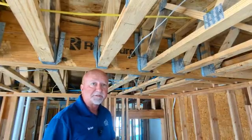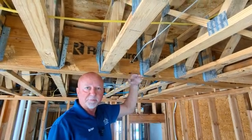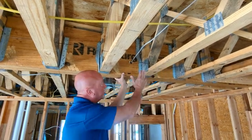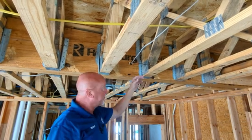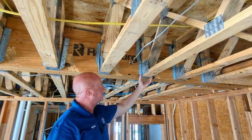Significant find for this particular inspection. So these are floor joists holding the support from upstairs. These are LVL beams. Basically, when we attach our floor joists to the LVL beams, we put joist hangers in to help support them to make sure that they don't slide out of place and they have proper strength.